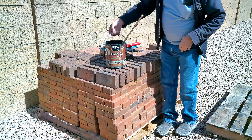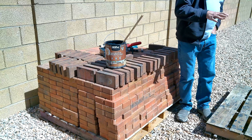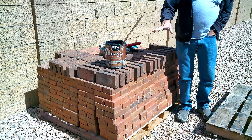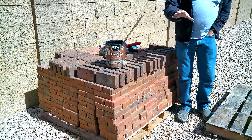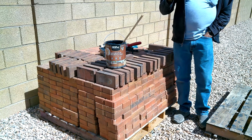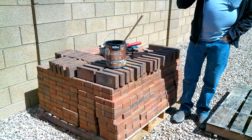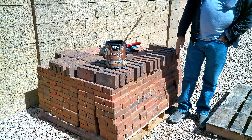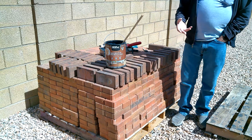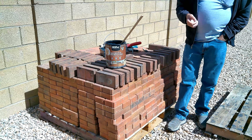This is one of the big things I wanted to show you guys — this concrete stain works great. You don't have to mix it in with the wet mix; you can do it after things dry and set. You've already seen the bricks that this has been used to stain. They go around our patios, they separate the areas, they go around the seating area at the bistro table. My wife has done all of that work and she does a fantastic job. The more coats you put on it, the darker it is. We are in Arizona, so actual black isn't the best option. This is a gray, so it's not quite as heat-absorbing as a true black would be.